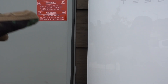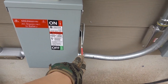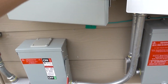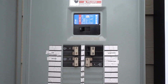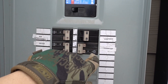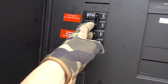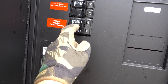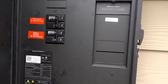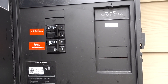Because I have a Tesla battery and solar here, I shut off the battery just in case — obviously when you lose power, the battery kicks in trying to power the whole house. So I shut that off. That's the battery side. This is the breaker to the sub-feed, which is that panel inside. So I turned that off. And on the Tesla side, I turned off all these here so that the battery won't turn on the PV breaker as well — just shut off everything on the Tesla side so that nothing gets turned on when it thinks it's off.